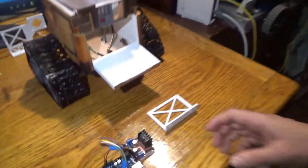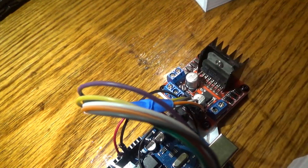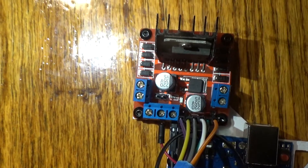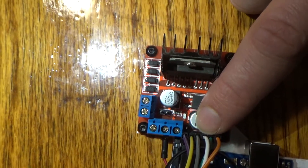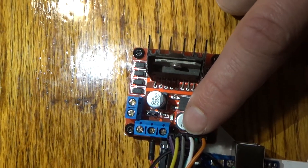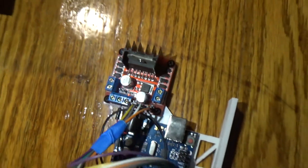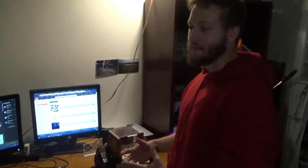On the Arduino we have our motor controller wired up. The two outside pins are PWM pins for the right and left motors. The two inside pins are enables. If you have a high on one and a low on the other, it goes either forward or backwards. Switch that and it switches direction. If both enables are the same — both 1 or both 0 — the motor stops. We do have to make some changes to the code and the guide we're following if we want to use these; otherwise if you run the other motors you can leave it as-is.